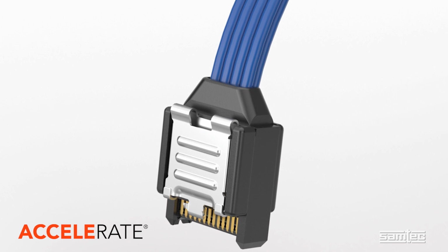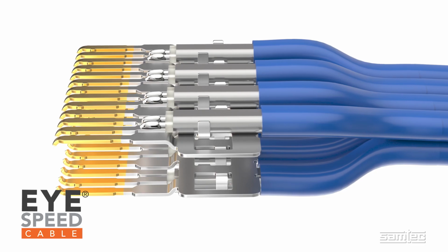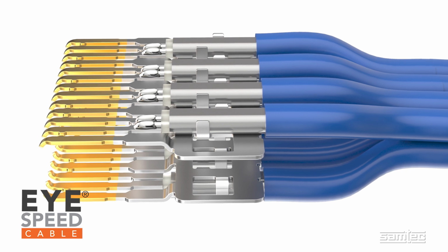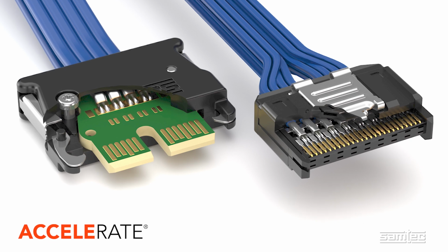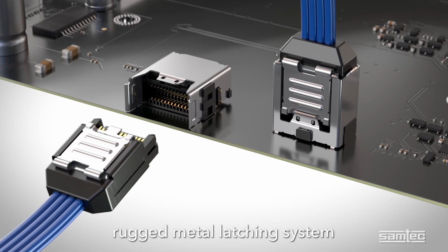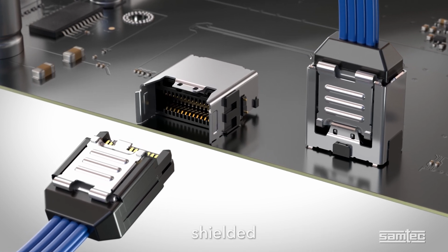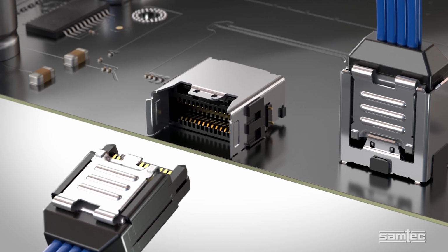All right, well, let's start at the beginning. Tell us about the original AcceleRate Slim. Sure. AcceleRate is the industry's slimmest cable system. It's only 7.6 millimeters wide. It incorporates Samtec's high-speed, ultra-low skew twin-ax with direct attach to the contacts. This eliminates a transition card from the cable to connector, and this improves signal integrity. A rugged metal latching system improves reliability of the ARC6 cable, and the ARF6 socket is shielded, and it has standard weld tabs to increase the mechanical strength of the connector onto the PCB.